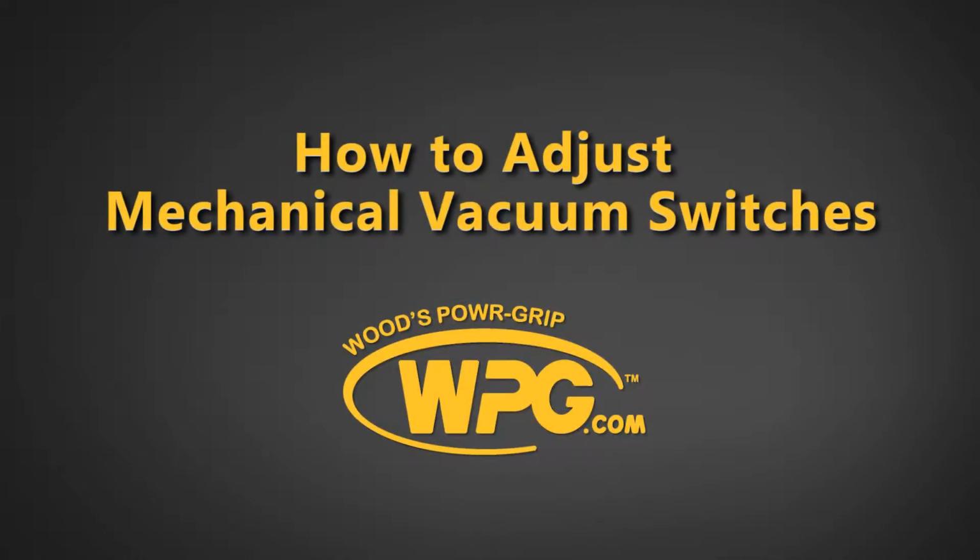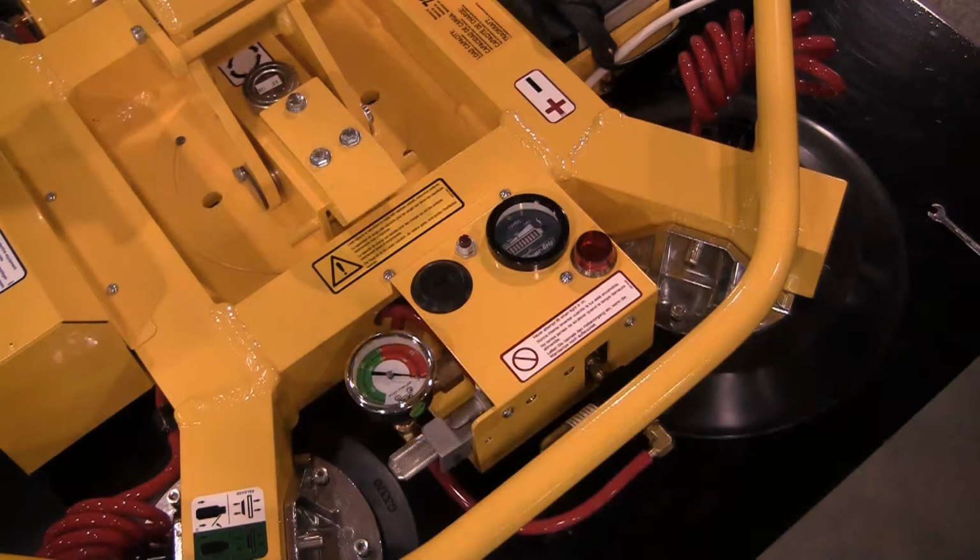How to adjust mechanical vacuum switches. The settings of a mechanical vacuum switch may be adversely affected by shock, vibration, or even disuse. When this happens, the switch will require readjustment. The lifter's vacuum pads must be resting on a smooth, non-porous surface in order to test the switch settings.